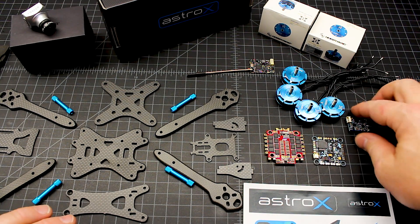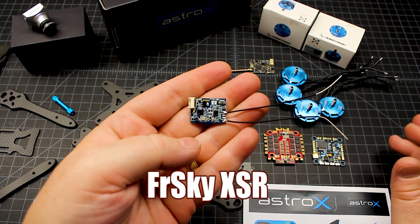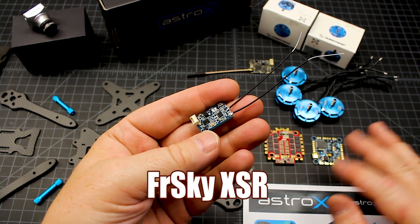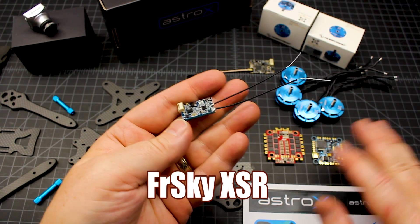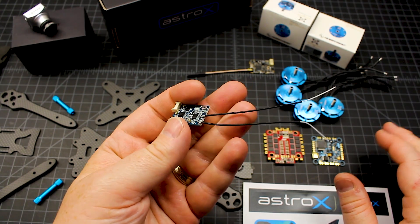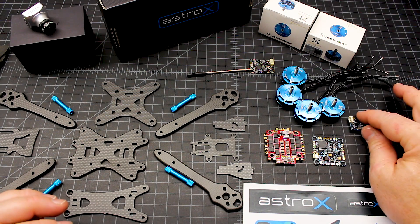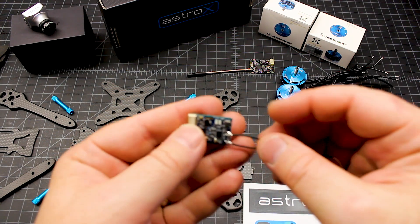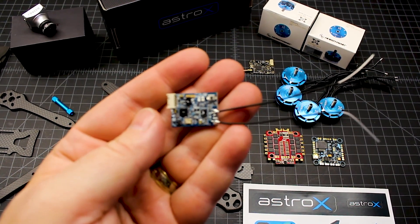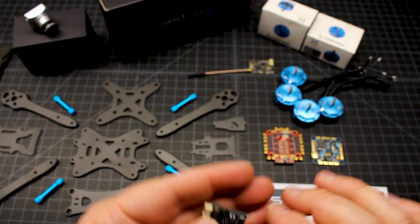This will take up to 6S. As far as receivers, we're going to run the XSR. I've been running the XM primarily and I love the XM, but I don't like that we don't get any telemetry — there's no RSSI. Sometimes I don't run a buzzer, and a lot of us use RSSI to find our model when it crashes. So I'm going to stick with the XSR. You can see it's not hard to solder on an antenna if you need to, and this customer would have no problem with that.